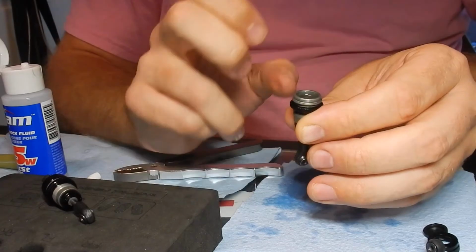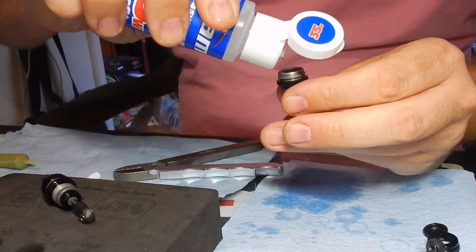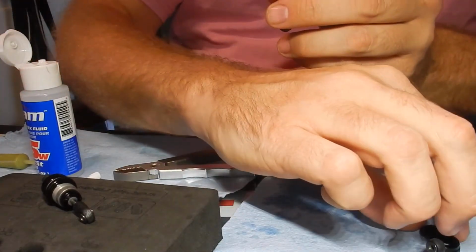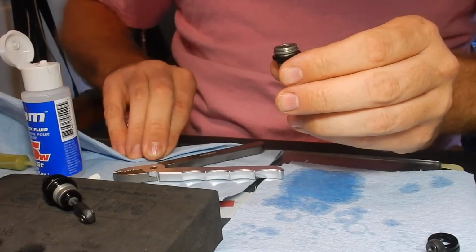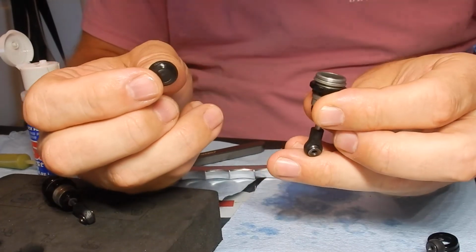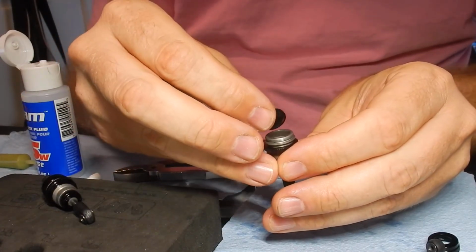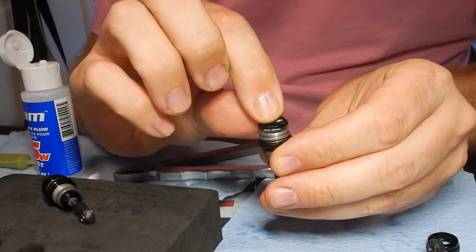More bubbles in there. So I fill it just to the top. Take my bladder, membrane, whatever you choose to call it. What I do is I push the piston up about 3/4 of the way again, and I put this on the side towards myself, inside the top of the body, and I roll it back. Hope you can see that.